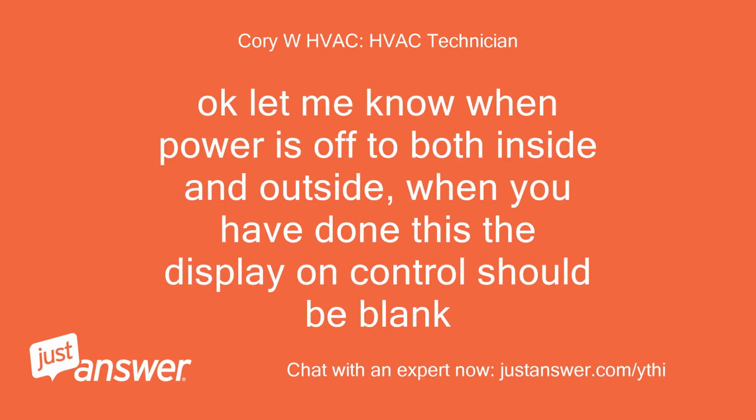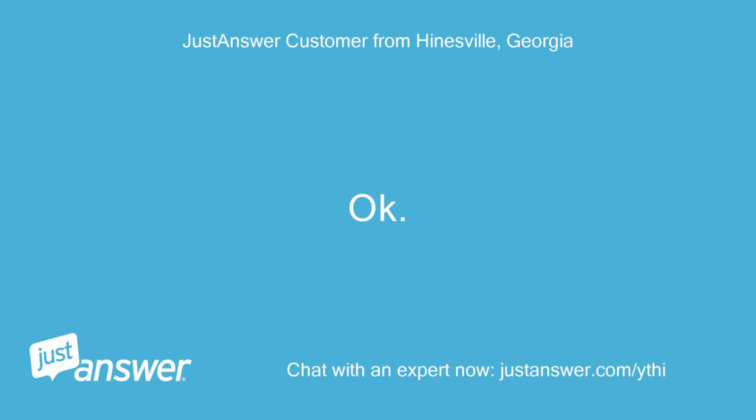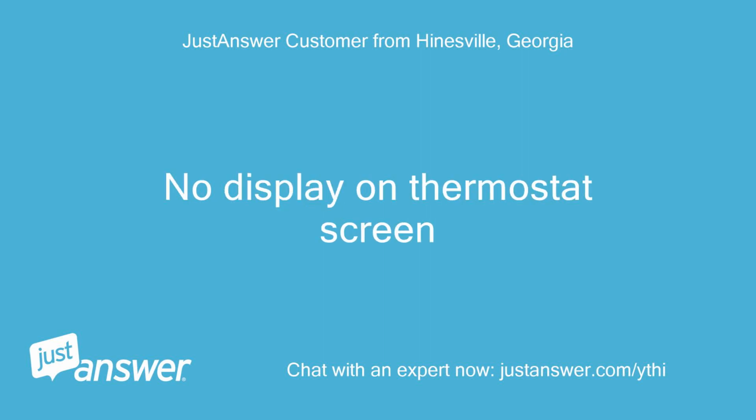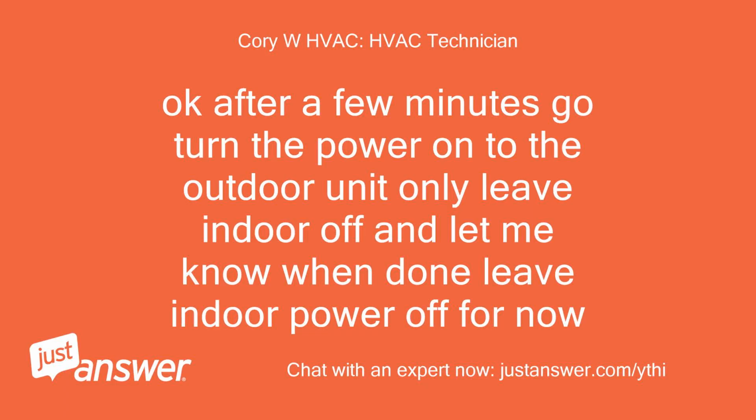Okay, let me know when power is off to both inside and outside. When you have done this, the display on the control should be blank. Any storms lately? Okay. Power is off in and out. No display on thermostat screen. No storms. Okay, after a few minutes, go turn the power on to the outdoor unit, only leave indoor off, and let me know when done. Leave indoor power off for now.